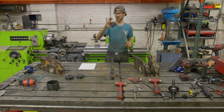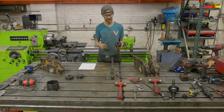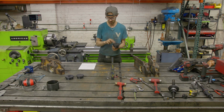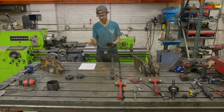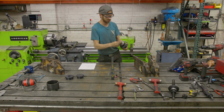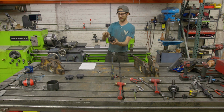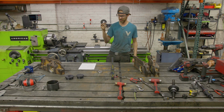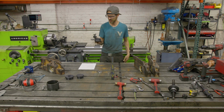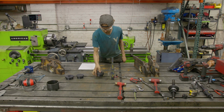To be honest, this one worked out great. I put it under a load of pressure, and I don't see any deformation. It looks great. I had it on 25 tons on the arbor press, no problem, and whatever the tonnage is, squeezing these. So this one, pretty successful. I'm going to make them a little bit thicker and up the infill a little bit more, but for the most part, I'm pretty satisfied. This is just PLA plus with 50% infill, and I think it's a grid style infill.